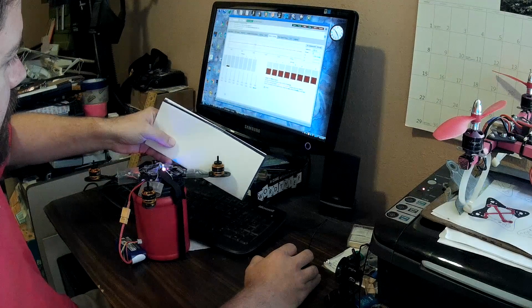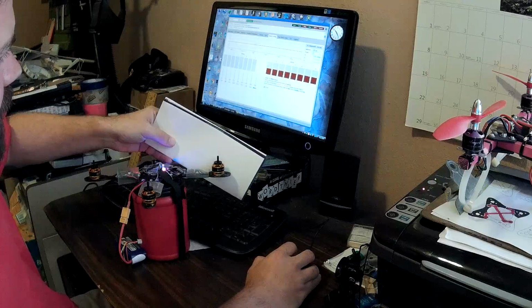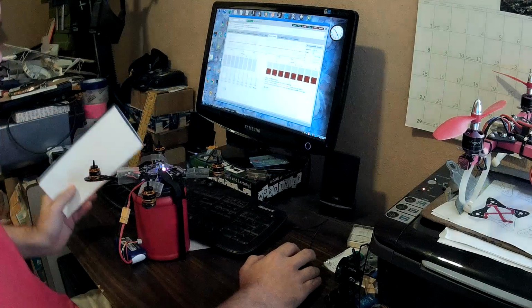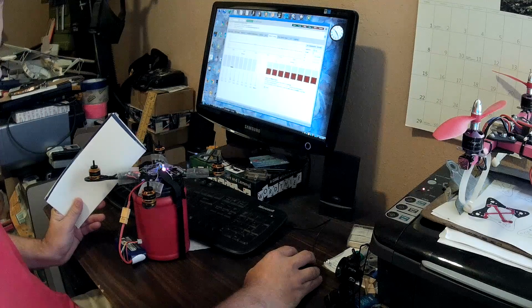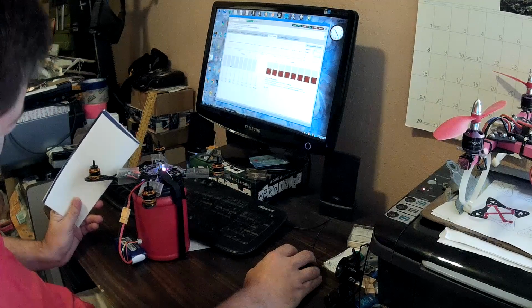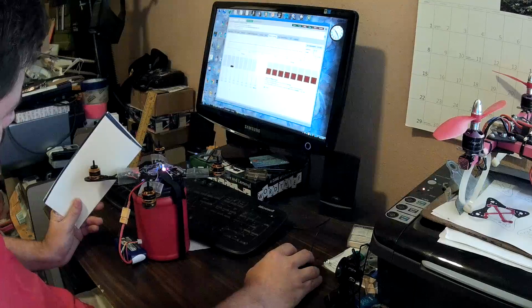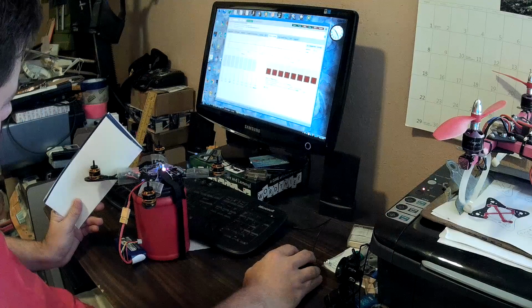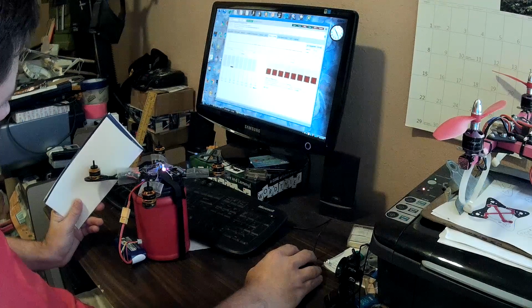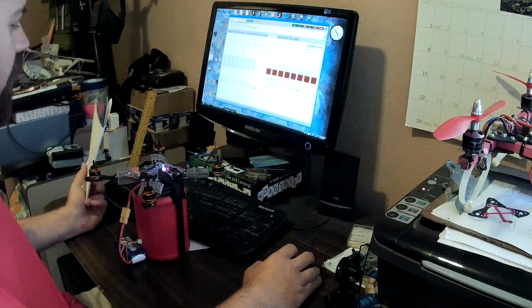So I tested all of these. And it's odd, I notice Baseflight sometimes gets stuck at 1,000 still running my motors up. But they all look square to me here, which is good, because I was worried that they weren't. Though honestly right now, doing it again, this one, number 3, looks a little fuzzy at the top. So I may try swapping this one. Yeah, it may be just a little out around this one. There seems to be some runout at the end of that shaft. So I may have found my problem, what was causing my wobbles.